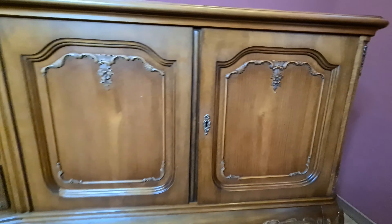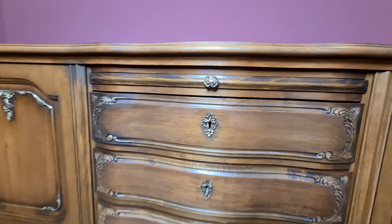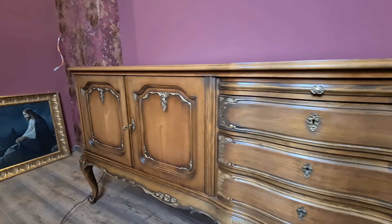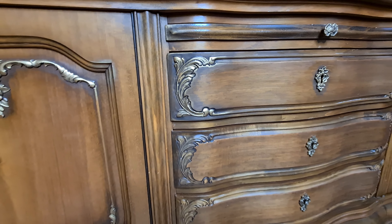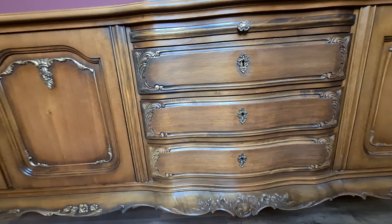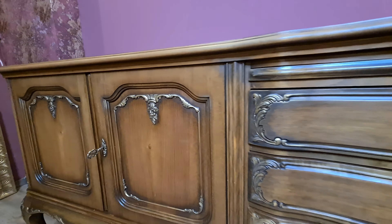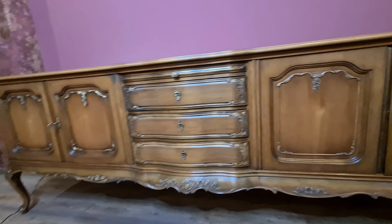For the rest of the furniture, I just cleaned it very well with the Dixie Belle white lightning, and after letting it dry for about an hour, I came back with some black wax and underlined all the details — moldings, key holders on this furniture. After that I applied gilding wax. This is really a beautiful project that everyone can do at home with a little bit of imagination and willingness to bring back the beauty of the natural wood. When I find a nice piece of furniture with no damage, I always try to save it and keep it shining in its natural beauty for many years.